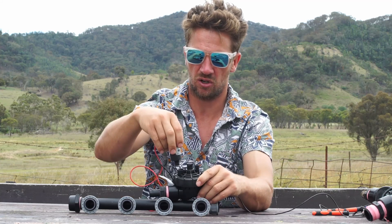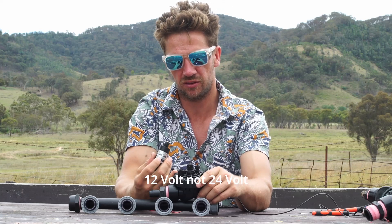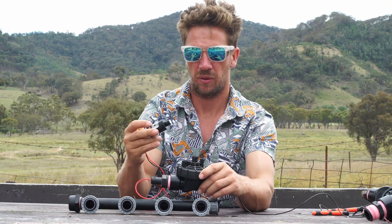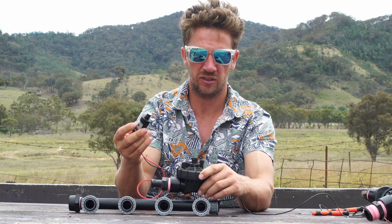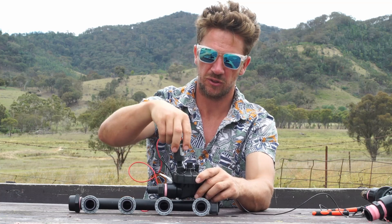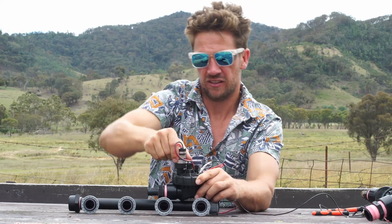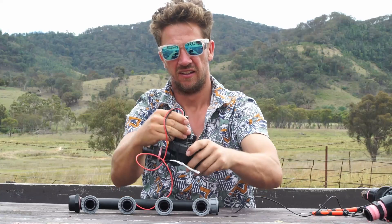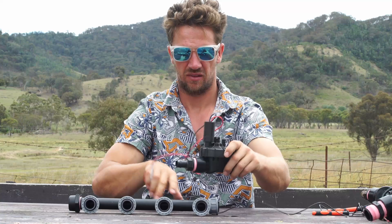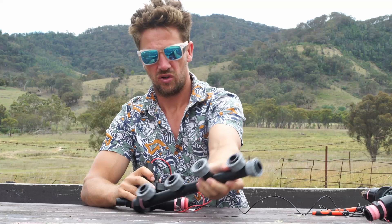There's an O-ring here so there's no need to tape this. The solenoid just goes into the diaphragm in this little hole. This is a 24-volt one — traditionally they come as 24–27 volt AC, but because I've got a DC power source in my shed I bought this DC version. The description will be below. You just push it in a little bit and righty-tighty — so that's in.